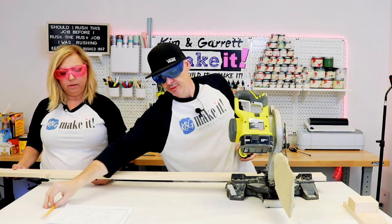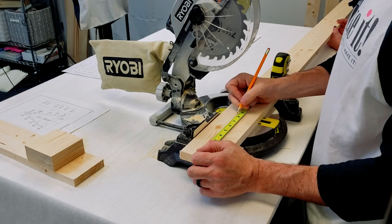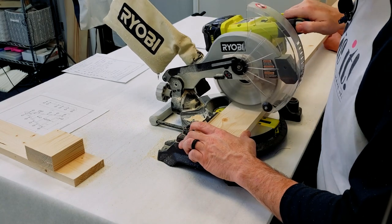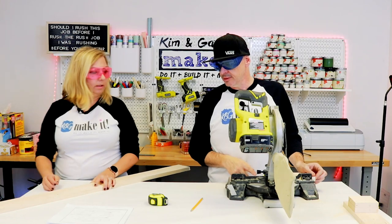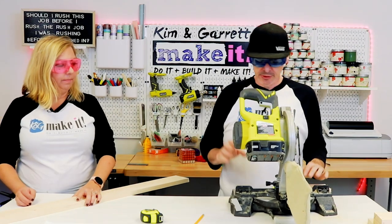7.75. You're gonna make your cut and then add your angles. Well, then I'll give myself a little bit. I'll give myself 8 inches, and then I'll sneak up on the angle. There's a little left over in this board, but not a lot, so don't give yourself too much. Six of this one, huh? Mm-hmm. Well, I'll do one, and then I'll make a stop block. Okay. All right, so what's the angle?